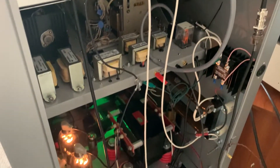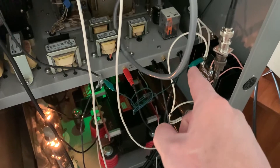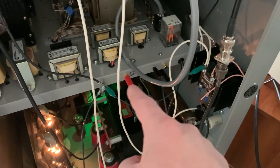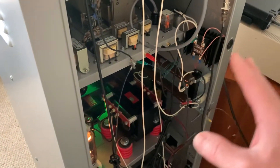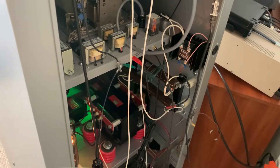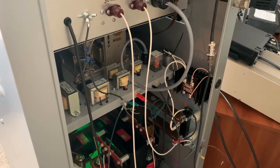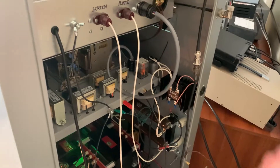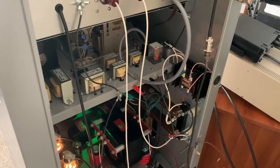It's working right now but I don't want to use it — I don't want to put it back on the air because my negative peak hits the baseline. You can see I have the output of that relay going to the limiter shorted to ground right now, so it stops it there. It'll go down through the resistors and load it down a little bit, but it needs the positive supply to create that artificial baseline and push it up above the plate supply's baseline. So I'm not going to use the rig on the air until I get that new supply built.